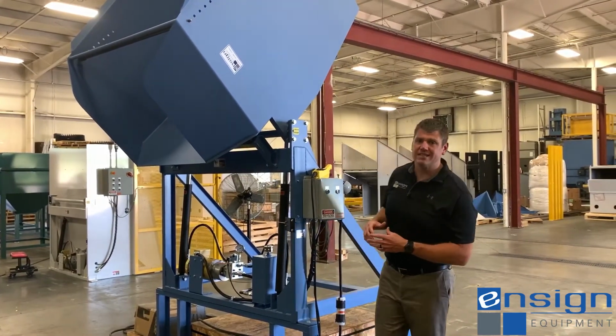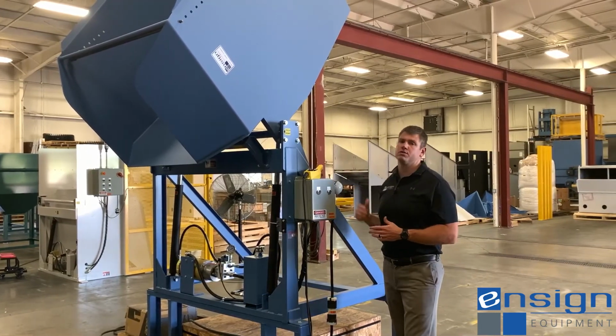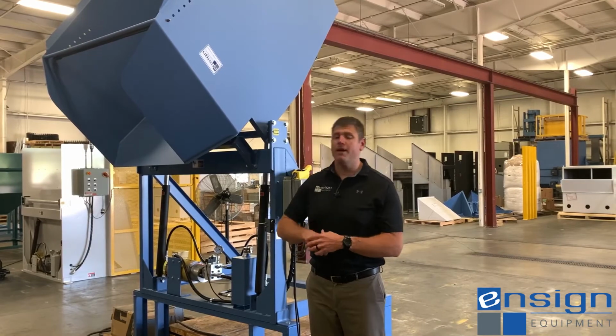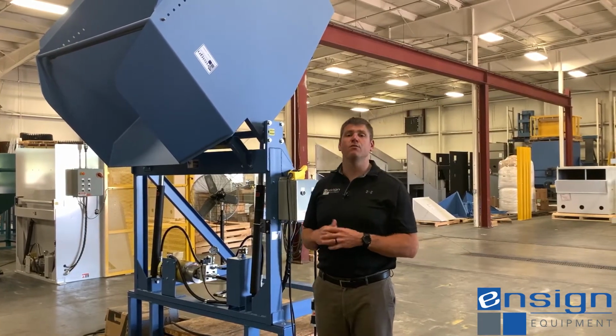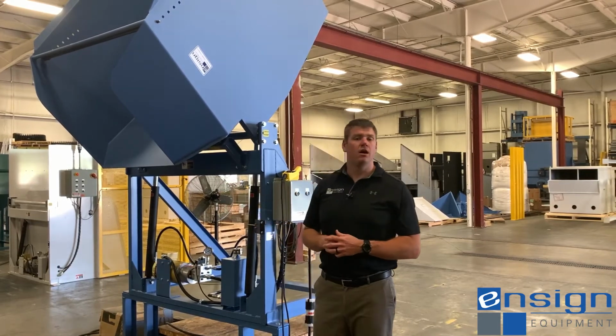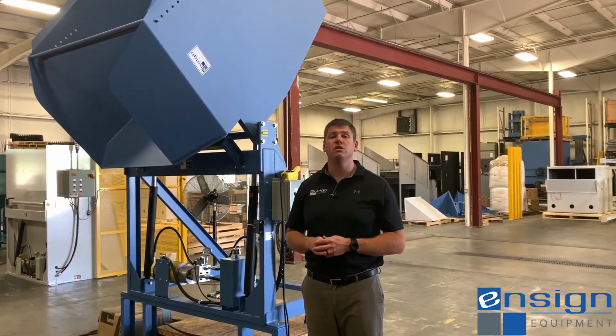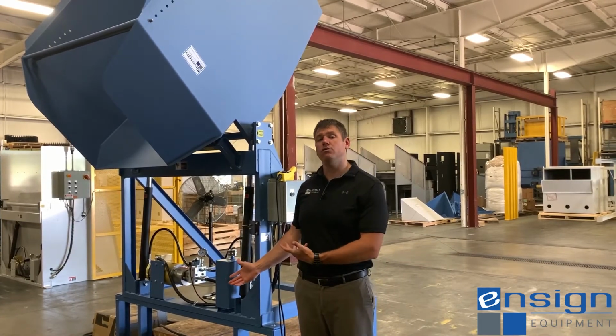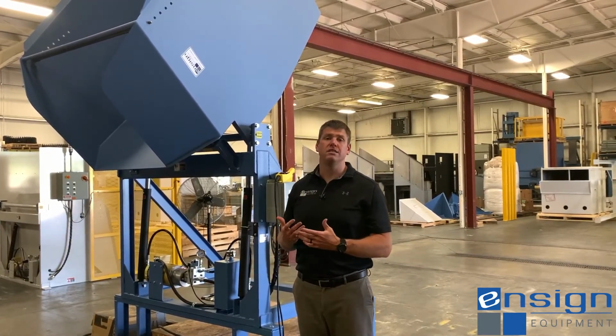When we extend them past their 24 inches of stroke, we're applying a lot of side load pressure on them, and we may actually even be popping heads of pistons off. We don't want to see that. We could get contact on the frame, all things which could eventually lead to seal failure, and now you've got a housekeeping mess as you've got hydraulic fluid blow-bying the seals.